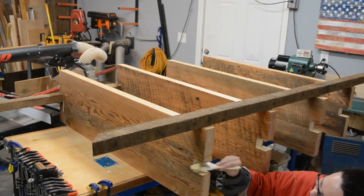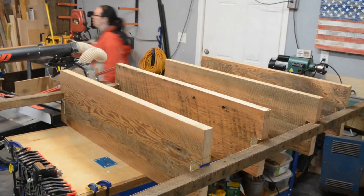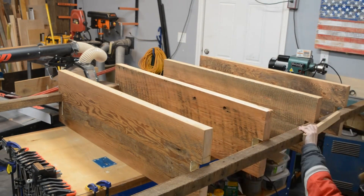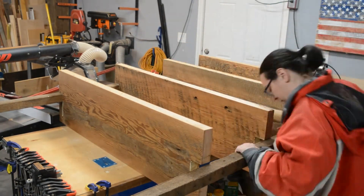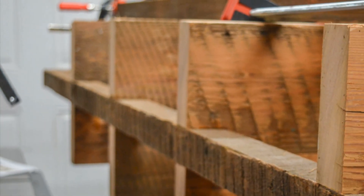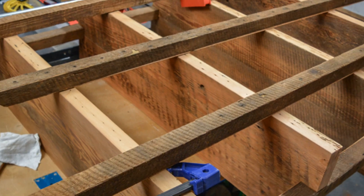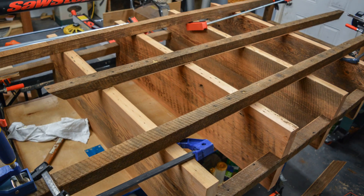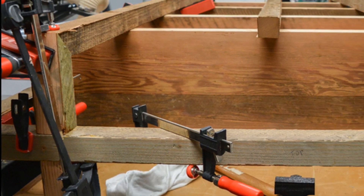Assembly was a tricky bit of work given the size of the shelf and the tight-fitting joints. I used pipe clamps to pull it all together. I did go back and add pegs to each place where the legs were notched into the shelves. I then assembled the rest of the legs a couple at a time, gluing and clamping as I went. I let each joint sit for about a day before securing with a peg. The process took a couple of days, but then it was time to put the shelf up on its own feet and start sanding.